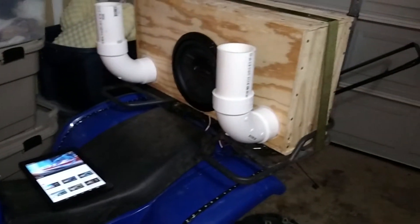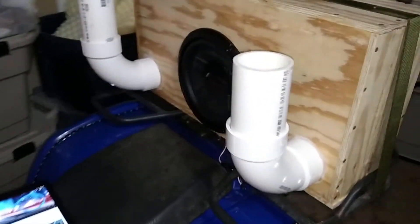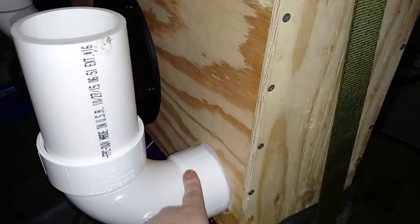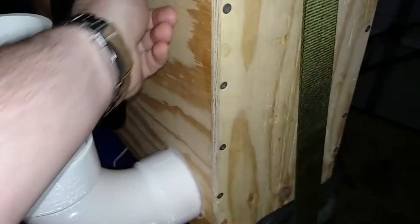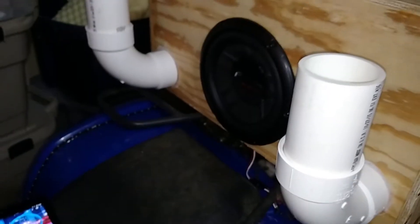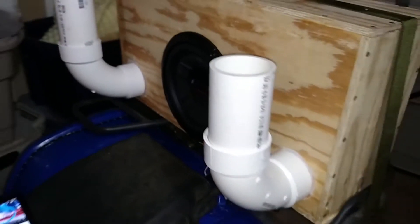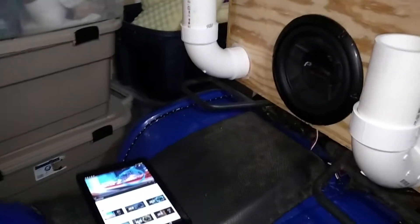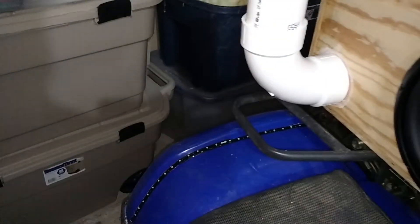I was doing some port tuning and I got it figured out. We want 35 Hz, we went with 18-inch 3-inch ports. Of course these will be smoothed up, and this is going to be reversed so this will actually be inside the box. It's going to cut our air space down a little bit, but I calculated for that and it will still get us 35 Hz. We'll have probably about 6 inches sticking out here of port because there is still port inside the box — 18 inches total.